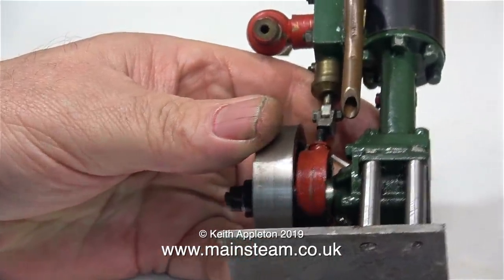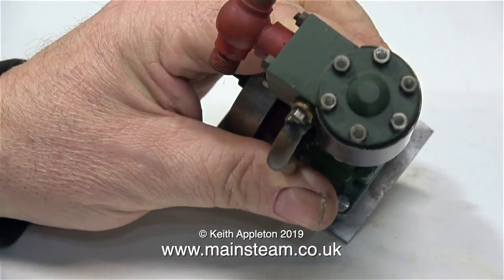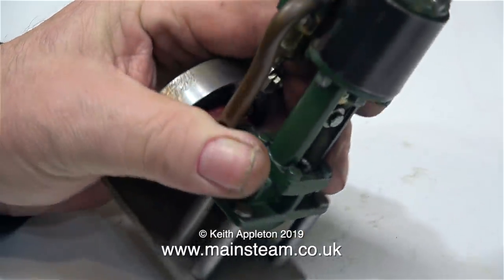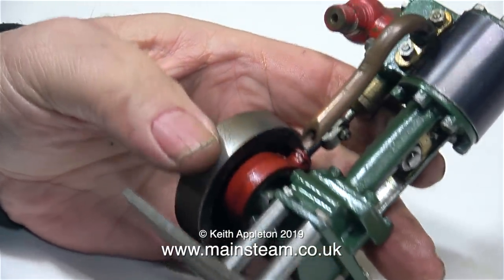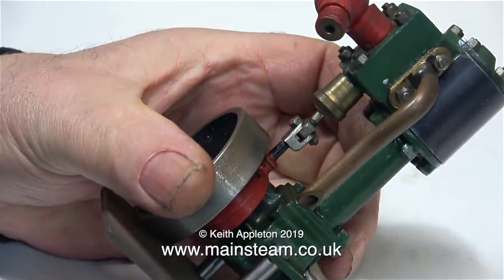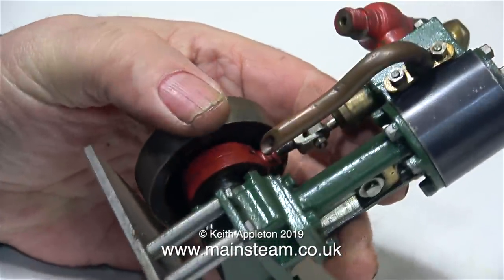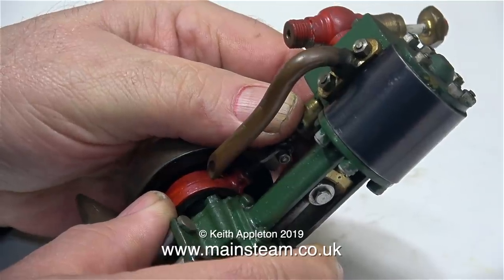This is a nondescript engine that was bought off the internet. What's wrong with it? Nothing really — it looks quite well made. All of the studs are very equidistant around the cylinder head. What I spotted immediately was that someone has had a pair of pliers on the copper exhaust pipe, and one of the studs on the steam chest sticks out a bit more than the other. The gland nut isn't well finished, and the flywheel is a bit rusty. Also, the eccentric strap is in one piece — it's not really adjustable. All those observations were made from the image on screen.